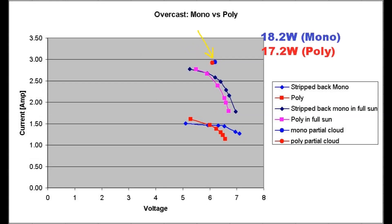What happens if you have partial cloud with breaks in between for some full sun to fall on your panel? What you get is maximum benefit from the direct sun as well as diffuse light from all around. These results were recorded back in September, so the noon sun was only about 60 degrees above the horizon, but it was nice and cool with cell temperatures only around 30 degrees C for both panels.